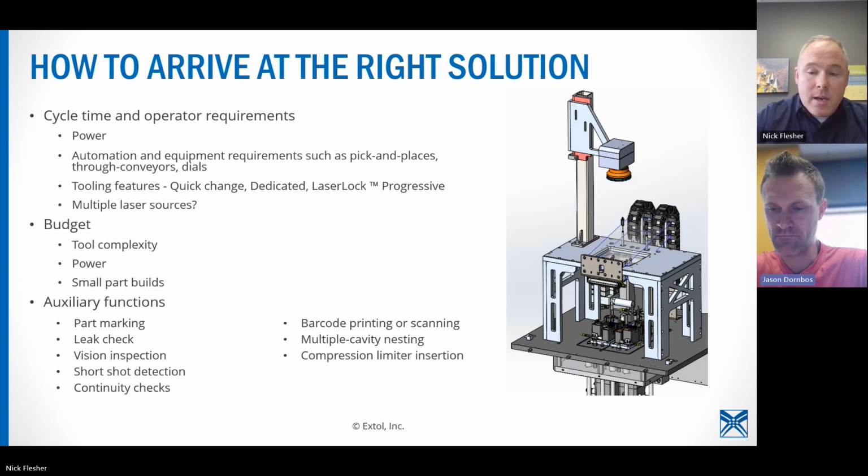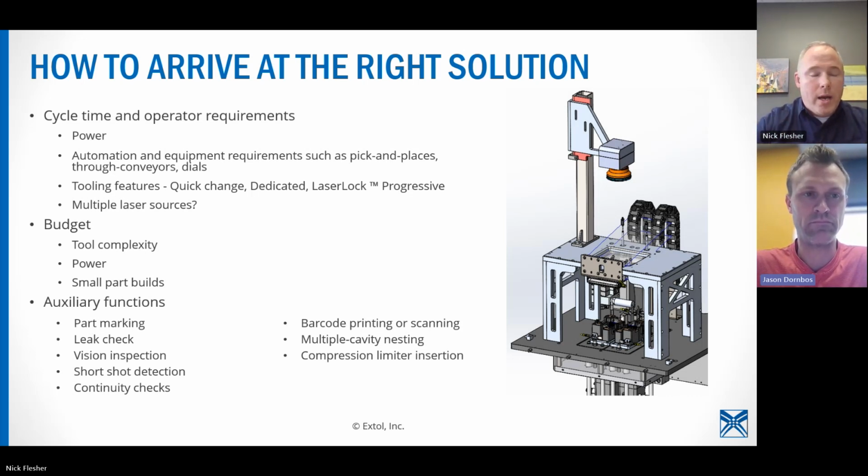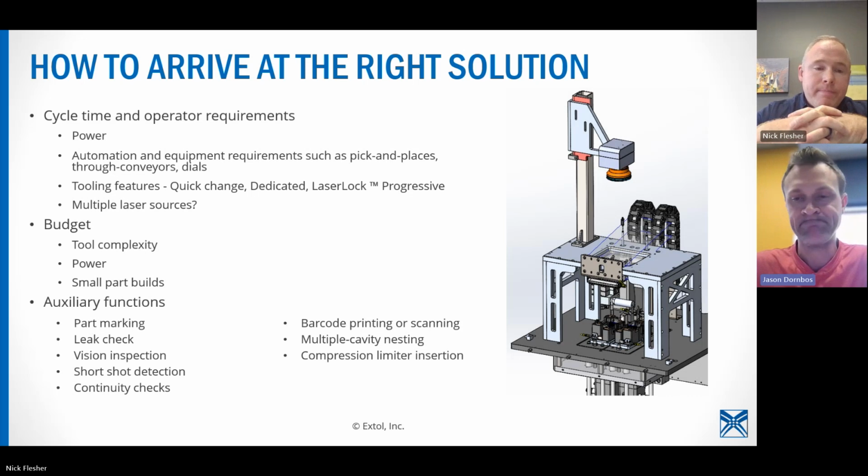Absolutely the second. You can't have overheating. That's actually why we broke up the laser you saw in the video into two. We had two 500 watt lasers instead of 1,000 watt. It's not uncommon where we're in the 100 watt range from a budget standpoint. It just might take longer to get there. So yes, you can apply too much energy too quickly and have a bad weld. That's right. Good questions.